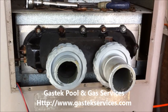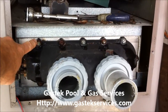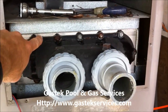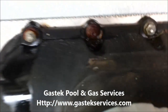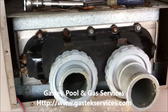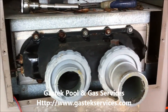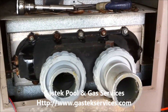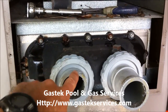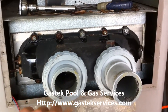What I'm going to show you is the difference between the old style and the new style. But first and foremost, you have to get all these nuts off of the header. As you can see, some of these are pretty rusted on there. When you get to that point, if they can't come off they will snap off as you try to take them out, and if they do, your heater is done — it's really a pain to replace. What I'm going to do is take this header piece off and show you what the flow diverter looks like, old versus new.